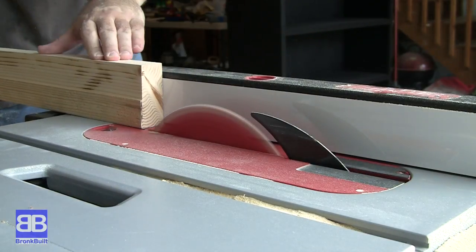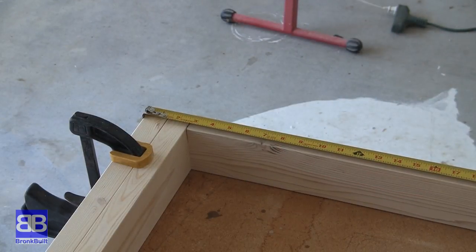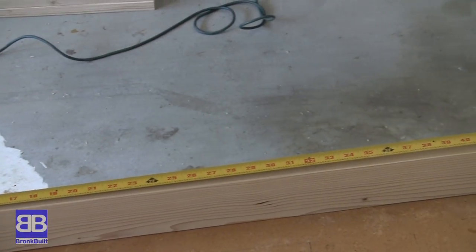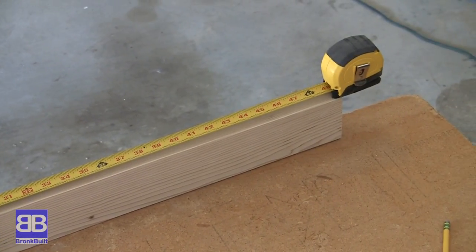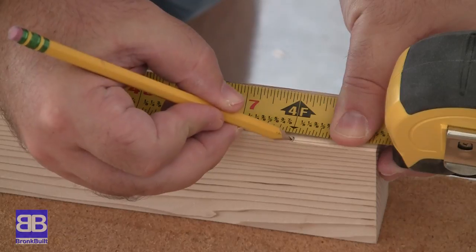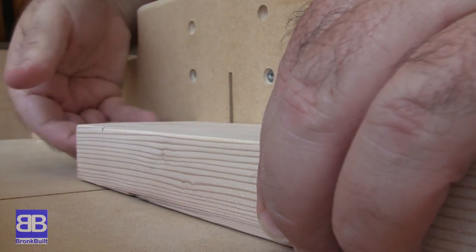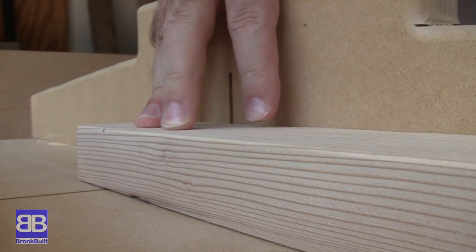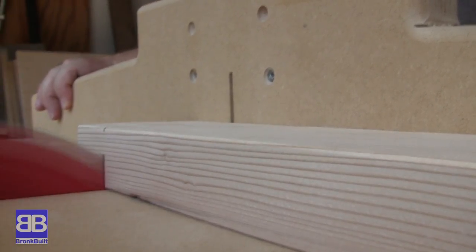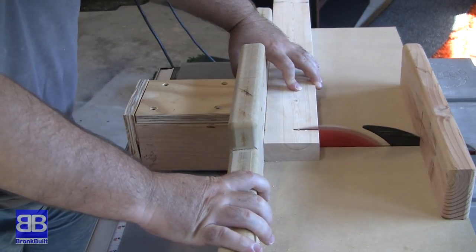Now that the sides of the 2x4s are cleaned up, they're no longer 1.5 inches by 3.5 inches. I need to figure out how long to cut the longer boards so that the total length will be 48 inches. The easiest way to do this is to forget math, because math is hard — simply take the two shorter boards together and place the longer board perpendicular to them, then measure to 48 inches. I know, perpendicular is a geometry word and geometry is math — I'm sorry. Now that I have all boards marked, I can cut them all to size with my crosscut sled: the smaller ones at 24 inches, and the larger ones at whatever length hits my mark, which will make the total length 48 inches. Did you know I have a video on how I made my crosscut sled? Look in the description below for a link to it.